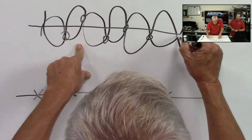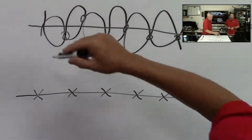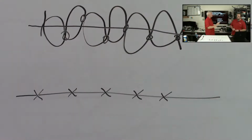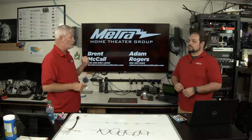So now that's a timing issue, correct? That is absolutely a timing issue. So what that means is one of the wires is going to be longer than the other wire. So the AC waveform will not be correct. Now we see this a lot on our side of the world because we get calls about a cable that's not maybe the best quality, or somehow, some way they've cut corners in the manufacturing of it, and that would cause this particular problem. And it will generally come because the winding machines are not properly monitored at the factories.